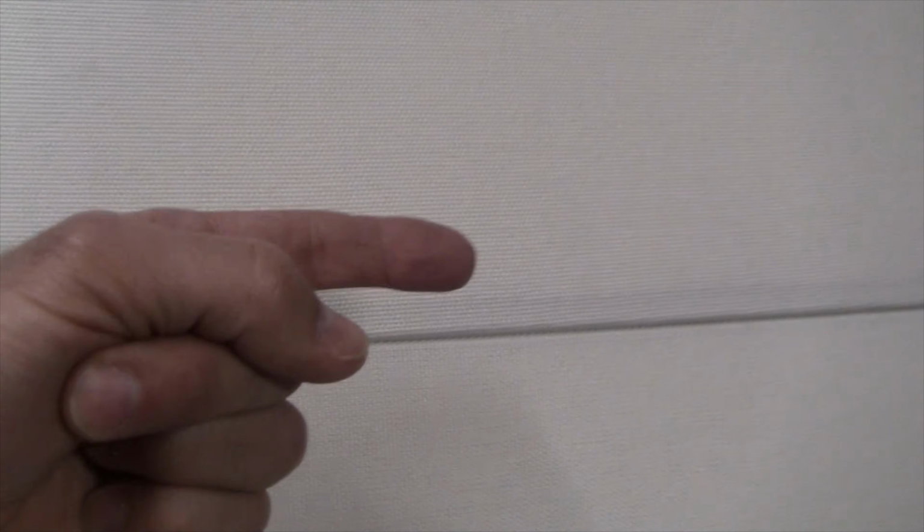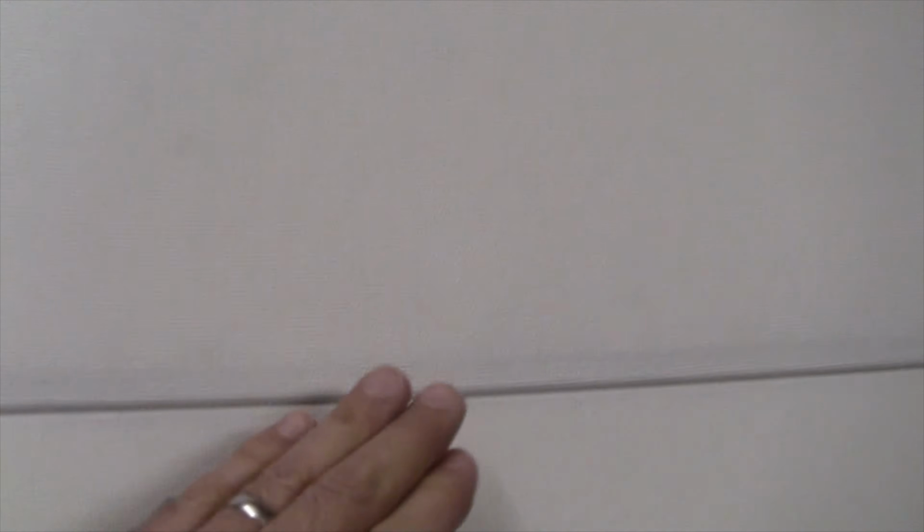Okay, that looks real good. Let me show you the detail on all the corners, and you can see the frame sticking out here. By the way, I should mention, when I'm using the tool, especially when I needed to rip this out, your frame has to be really securely attached to the drywall. Really securely attached, because if you pull out the fabric, you're pulling the frame off the wall if your frame is not 100% attached to the wall. So your frame has to be really attached to the wall.